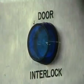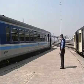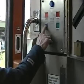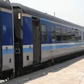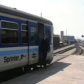The blue interlock light will now be extinguished on the driver's desk and on the door control panel. When station duties are complete and he has obtained the right-of-way from the platform staff, he closes all external doors by depressing the blue close button. He must now observe that all doors are closed and all external yellow hazard lights are extinguished.